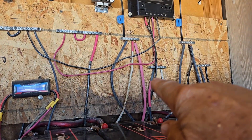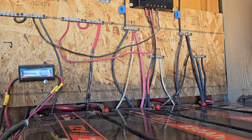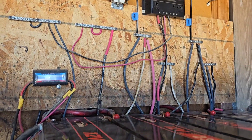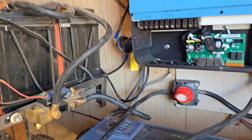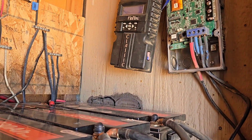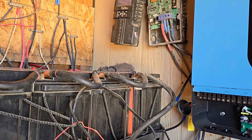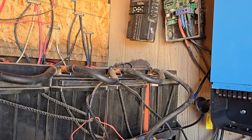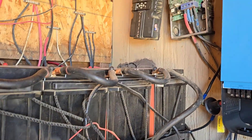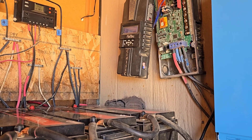I've got extra wires connected up because I'm also bringing in some 100 watt panels that are going into the bus bars, all feeding the system in combination. I'm going to be ending that right now. I'm at full charge — 14.6 volts in the batteries — and that's going to change because now I'm going to be going to 48 volts. Everything's going to be shut down, disconnected, and then I'll start rewiring everything. Stand by, everybody — this is going to be an interesting video tonight.